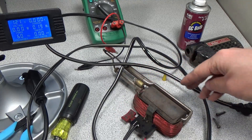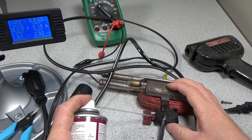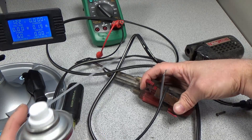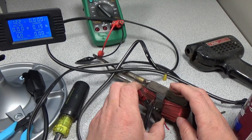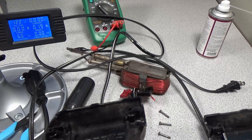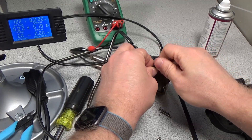I'm not going to do anything to most of this. For the switch I'll give it a little bit of a clean — just a little contact cleaner sprayed in there — then operate it a bunch of times and wipe it down with a paper towel. Got it all cleaned up. Let's get it reassembled and see what happens. I'm going to put a slightly bigger wire nut in and hopefully there's enough space inside the case. Could solder this connection also, but that should do.